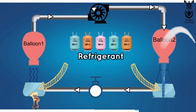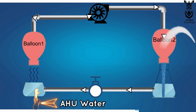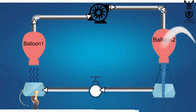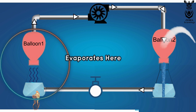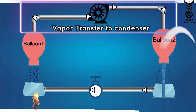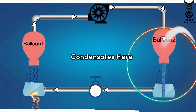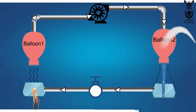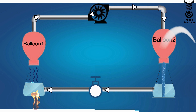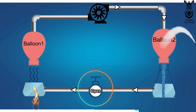This water represents the refrigerant — the gas we use in an air conditioner. The heat source represents the hot water coming from the AHU. The hot water from the AHU transfers its heat to the refrigerant, causing the refrigerant to evaporate and become vapor. The refrigerant vapor then goes to the condenser through the compressor, where it is cooled by water coming from the cooling tower and turns into liquid again. The liquid refrigerant then goes to the expansion valve, which controls the required amount of refrigerant sent to the evaporator.